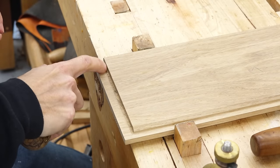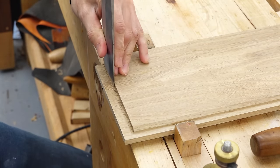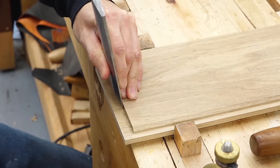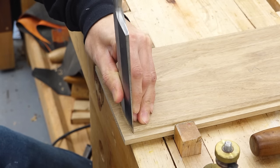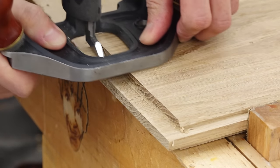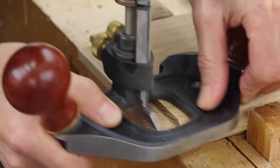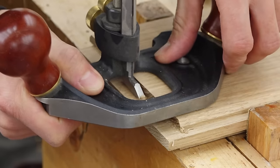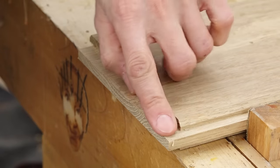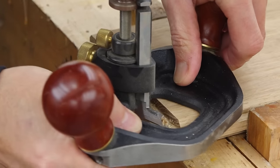I have just a little bit of junk right here to clean up real quick on this tenon. And then I have a router plane set to the actual finish thickness, so I can check and make sure my tenons are the right size. If there's any deviation when I actually form these, this will find that and knock down the high spots.